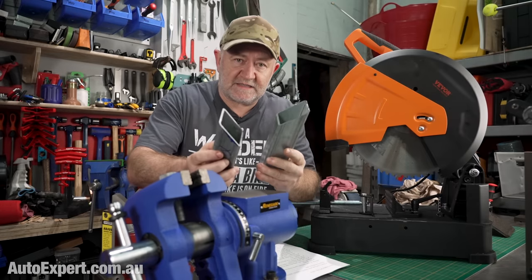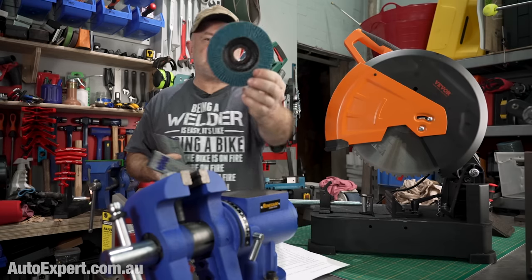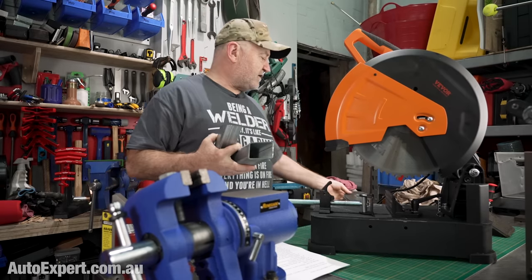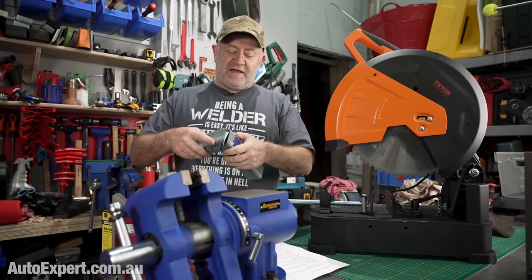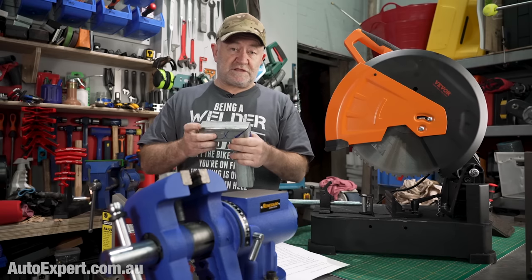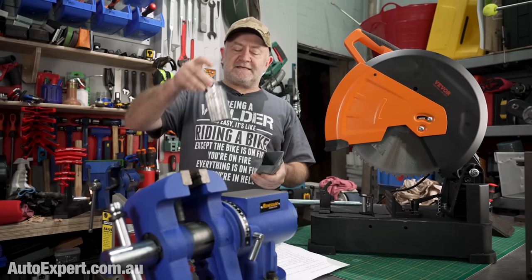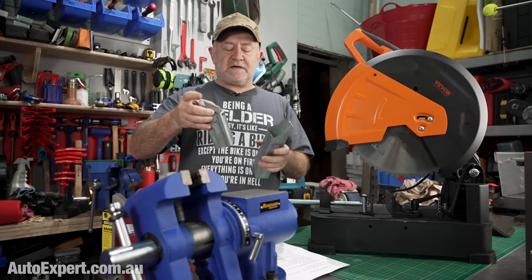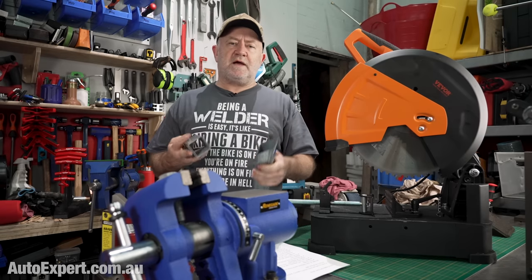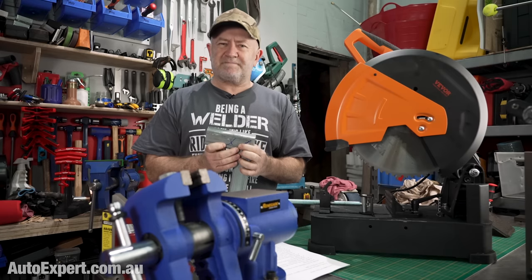One caveat on welding galvanized — it's really dangerous. What I'm going to do before I weld is get a flap disc or sanding disc and come back about 20 millimeters from all the weld areas and knock the galvanizing off. Once you're doing your welding into a molten pool, if there is zinc present — the fundamental constituent of galvanizing — once you ionize that, the vapor is extremely dangerous to breathe. You could also dip the ends about 20mm deep in vinegar for a couple of days — the acid will eat the zinc and leave you with clean steel. Then just spray it with cold gal and paint it as planned, and there won't be any elevated corrosion risk, and you won't poison yourself in the process.